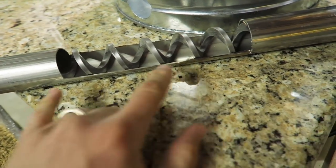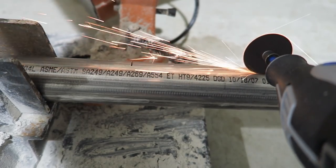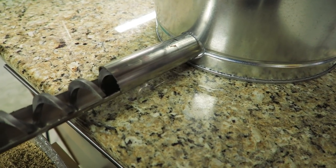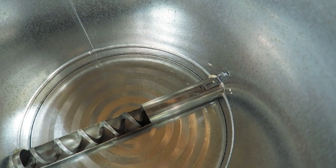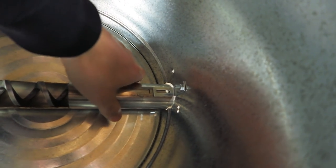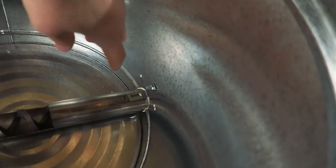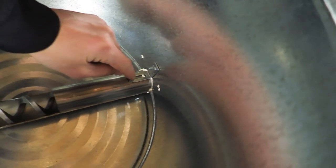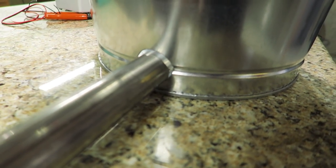The first thing I did was take the stainless steel pipe and cut it a little more than before, so there's more area for the feed to get into the corkscrew drive. I'm going to insert this into the holes and show you what I did on the other side. I installed a bracket back here which will hold the pipe securely so it doesn't want to rotate. When the pipe is filled with feed and the shaft is rotating, it does want to spin the pipe — this bracket should prevent that.